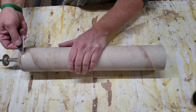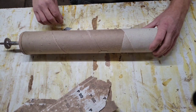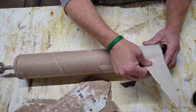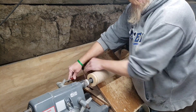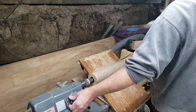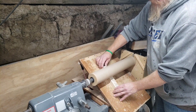What we're gonna do is grab this old paper and peel it off this cardboard drum. I know what you guys are thinking — you're thinking that I'm peeling away some of my drum. Well, you're right, I am peeling some of it away. But here's where the beauty of having a cardboard drum is: I'm actually going to tune this drum. I'm gonna reinstall it back on my drum sander. I'll take my tuning block — a piece of hardwood about an inch thick, an inch wide, and about six inches long — with some 80-grit on it. I'll get it adjusted to where it's just barely touching the drum, flip it on, and start to tune my drum. What I'm doing is really taking off any of the high spots and trying to match some of the low spots.